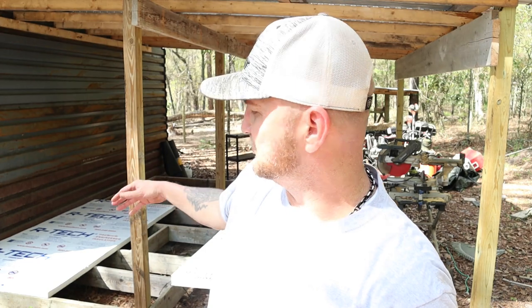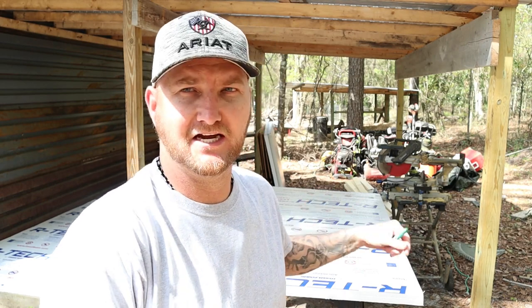What we're going to do is get our first two runs of foam board down. The first sheet I don't have to cut. The second sheet I do — it's just a little bit out of square. So I went ahead and measured on each end, I'll pop a chalk line and use the skill saw to cut the foam. I'll use where I cut the foam as a template to cut the plywood, that way I don't have to re-measure everything twice.